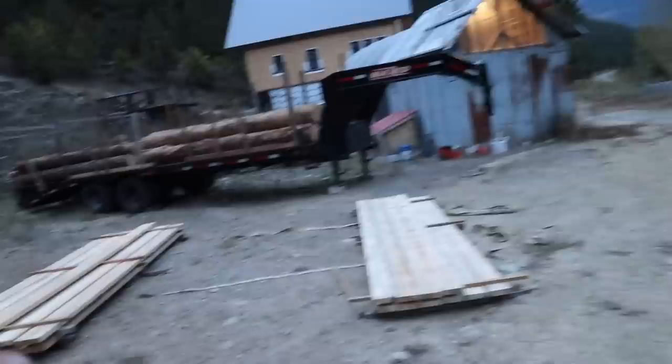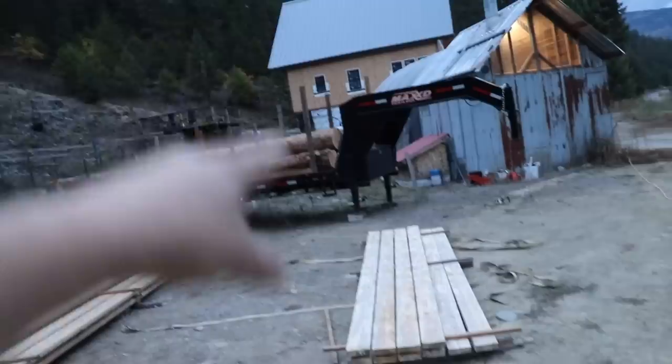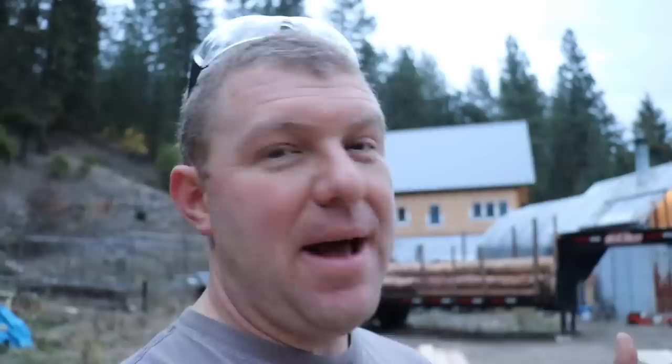That stuff's going to be chips in the garden. One more day of this — I feel like we should have gotten a lot more done, but it does feel good to get this log out of here and have more room to walk. We've still got a ton of wood left to get through, but it feels good to start having lumber on the ground. We're hoping to make a couple of units of 2x6 and 2x8 nominal lumber — a couple of nice fat stacks stickered and drying so that when we get ready to build the interior walls, we have the lumber ready. Dinner's ready, time to spend time with the family. I've got to decide whether I have time to do this tomorrow or reschedule the chipper — neither is a great option.